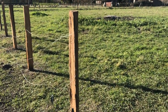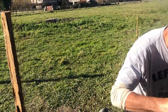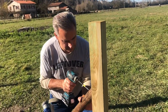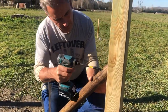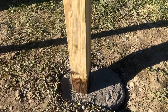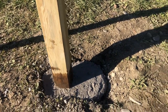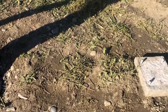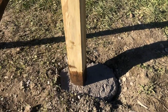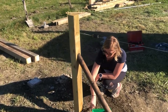So we have done away with our wooden stakes which we're using for the fence posts, and we've actually got a proper treated gate post, because we're having a gate attached to this. Ian's just fixing the stay on, and this time it's got 50 kilo of cement, yes, a little over the top, but after the third time, it's going nowhere. Plus we sunk in a metal rebar that is attached to that one now, so this shouldn't be going anywhere.